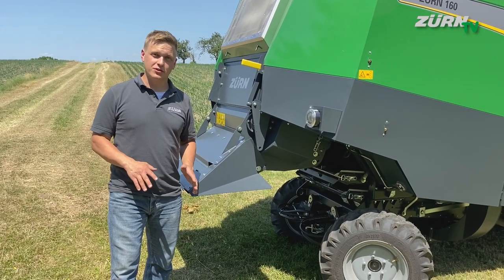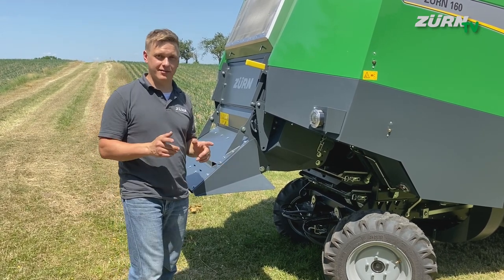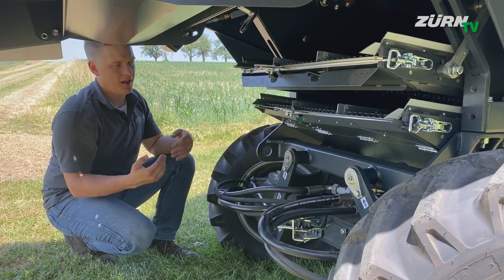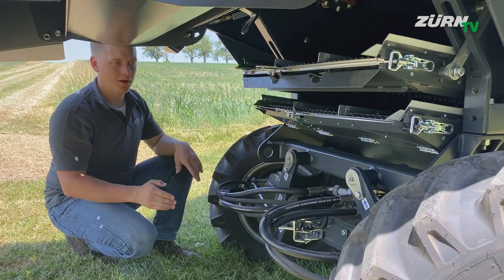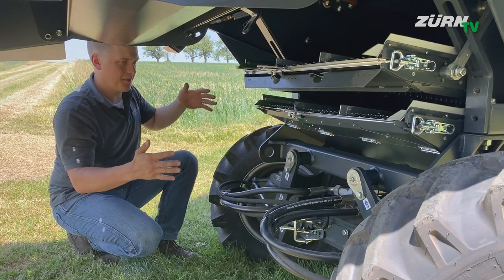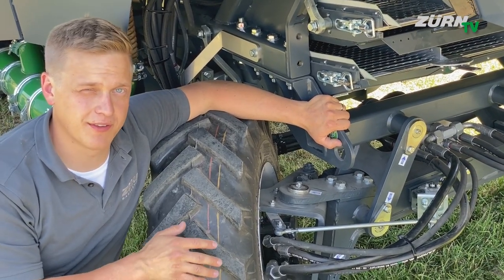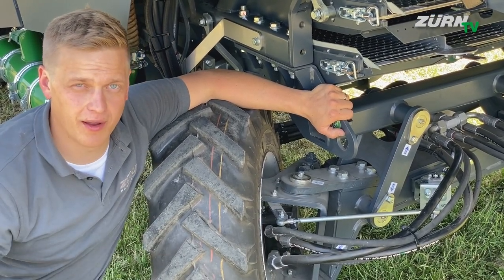After the functional components, we will now focus on what actually moves the combine forward. Let's start with the rear axle. This massive multi-link rear axle moves to the side while it pivots, allowing enough clearance for the tires to be at full lock for a good turning circle. Even in rough terrain the machine has good stability. This machine is equipped with a fully integrated John Deere AutoTrac system — that's why we have this steering wheel angle sensor at the rear axle.